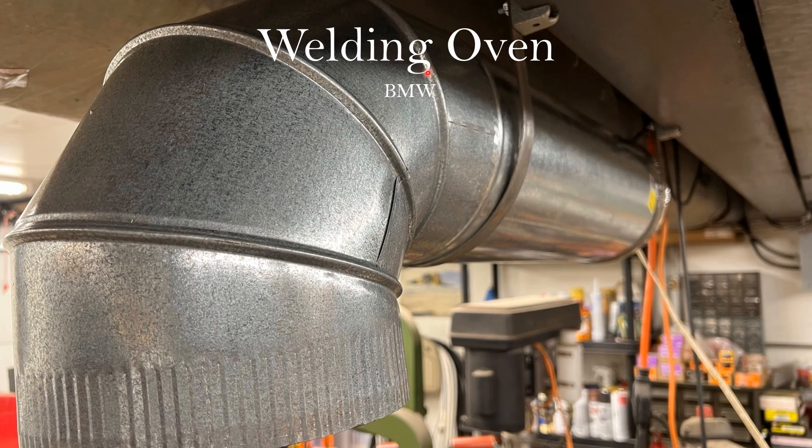That's my welding oven. We'll see how long this light bulb lasts — I'm going to eventually replace it with a big resistor instead, but I want to see how long the bulb lasts first. It's plugged into GFCI. It's metal, fiberglass, metal rods inside, and a glass incandescent light bulb that everyone's been using for 100 years. So it's essentially just a light bulb in a piece of insulated metal. I figured I'd share what I did — I know a lot of people were talking about whether they need a welding oven, and I'm pretty happy with this one, especially when you have parts just laying around.